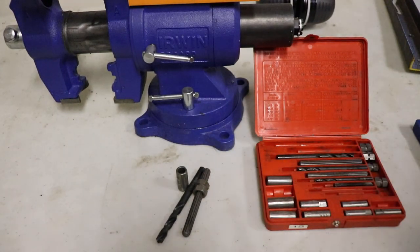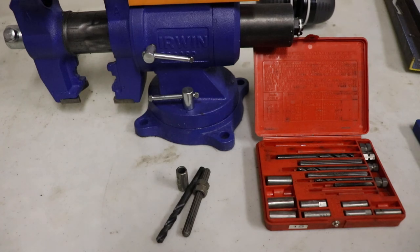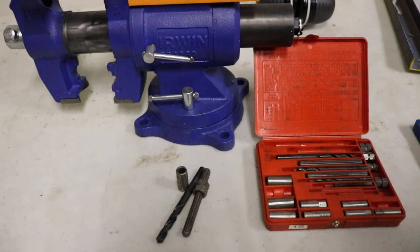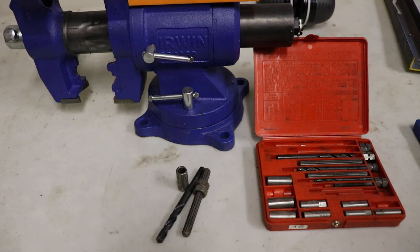I'm hoping not to break any bolts off because that's really what you're trying to avoid — do everything you can to avoid breaking it off. But if you do break it off, you can use a kit like this to extract it. They also have different heating elements now for removing bolts. You put a collar over the bolt and it acts like an induction heater — it heats up the bolt, generally breaks the corrosion bond, and it works pretty good. Thank you for watching.